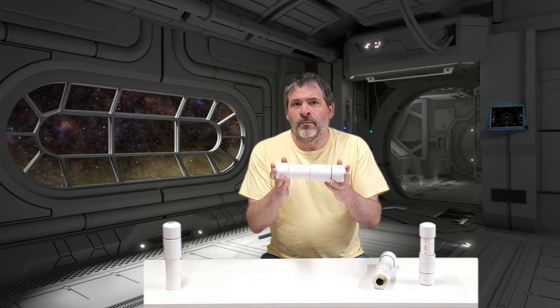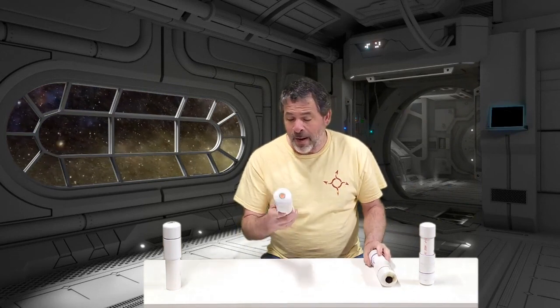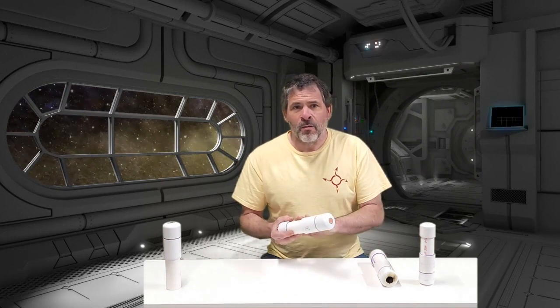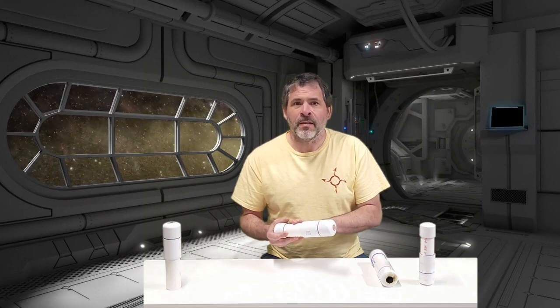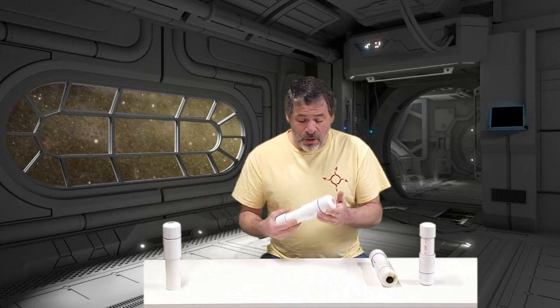It is quite a bit heavier, but hopefully it still has enough thrust to deal with that. The big danger of this particular one is it's going to explode on the ground test because we are still using the number 20 nozzle — number 20 for the last round test and number 20 here. The math shows that this motor will build up a significantly larger amount of pressure inside the casing. That's good because it gives us significantly larger thrust, but it also means a good chance it's going to explode. If it does, we can up the nozzle size to a 22 — but if we increase that nozzle, that decreases our pressure and decreases our thrust, which is the opposite of what we're trying to accomplish. So we'll see how today's test goes.